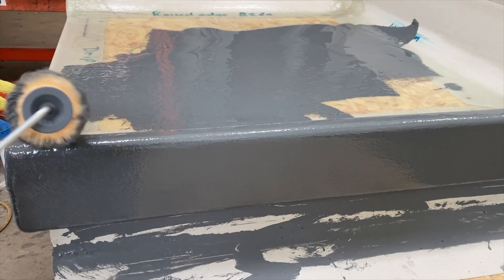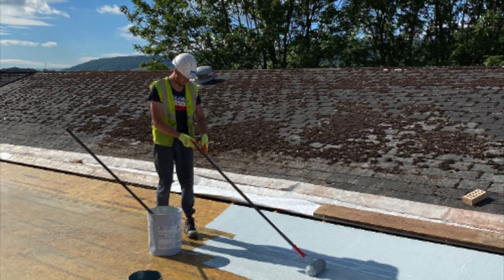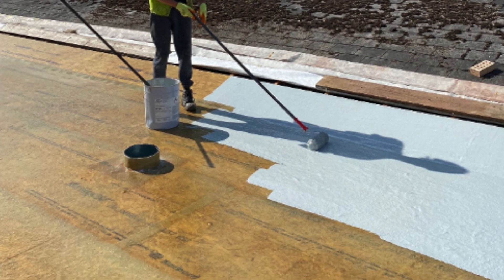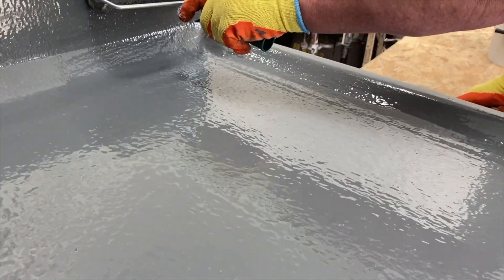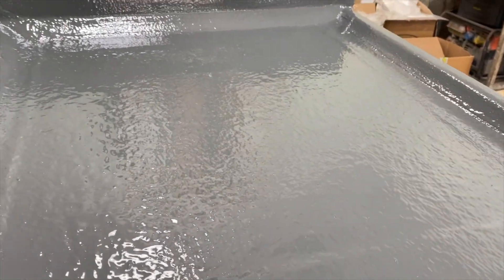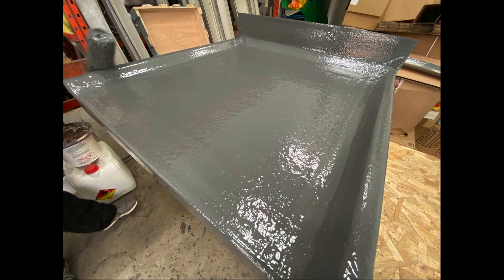A brush may be suitable for more complex sections or harder to reach areas. Aim to start in more distant areas, ensuring a safe, clear exit from the roof when the final section is applied. Be sure to keep the top coat application consistent. Excess amounts of top coat are likely to create a brittle surface prone to fracture and cracking, while too little top coat will expose the underlying glass fibre to moisture.